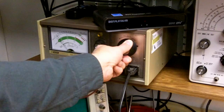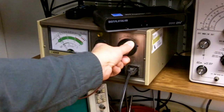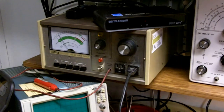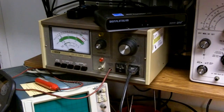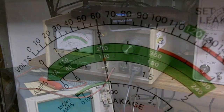I'm going to bring the voltage up slowly. I'll go to about 20 volts. I've slowly brought it up to about 20 volts, and now I'm just going to let this sit for a few hours, then bring the voltage up a little more. I'm going to do this in steps over a period of a day or two, letting the radio sit and cook while I bring the voltage up — maybe 10 or 20 volts at a time.